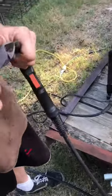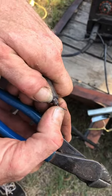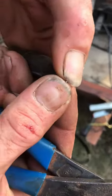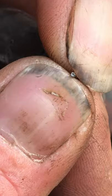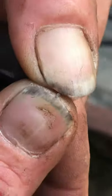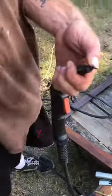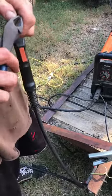You always want to clean the first bit of wire first. You see the wire's bent and that first bit has discoloration — there's a booger effect on the end. You can see how it looks hollow on that very tip. There's flux in there and that's what creates the gas for shielding. When you hook it up to a bottle and use argon gas, you don't have that shielding inside the wire — it's solid, so you get a better outcome. The flux core has to create the gas with that flux in the middle, so you get kind of an ugly weld that looks like stick weld.